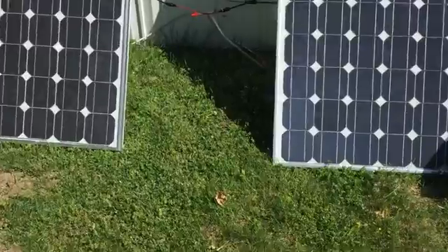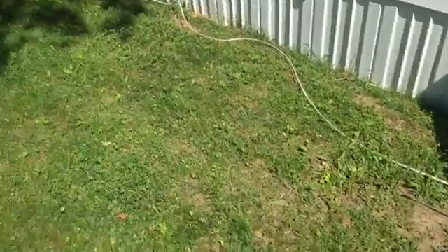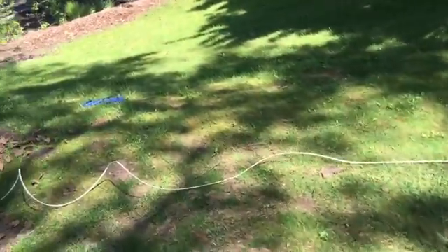Batteries are at 27.7 volts — we've got a green light. I'm running this electrical wire which is 14 gauge, which isn't really heavy enough, but this is just a test. I've got two solar panels out in the sun, connected together in parallel at this junction. It's only two panels at 4.95 amps each, fed through this long run of 14 gauge house wiring. We're down to 3.7 amps and we're charging at PWM on our batteries, and it's working.